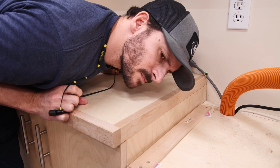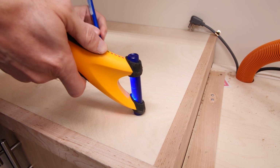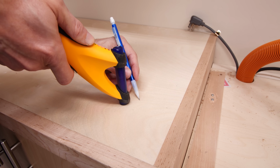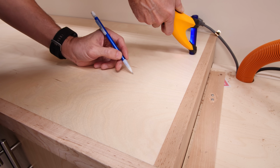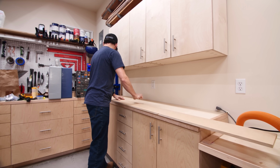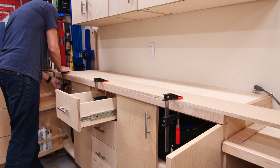And apparently my microphone was off, so it sounded something like this. Beep, beep, beep. I was able to find the screws and some of the brad nails, but I just tried to avoid the screws because there was a lot of brads. Now I don't have an edge guide, so I used a long strip of 1/2 inch MDF cut to size that would put my bit right where I wanted it for the T-track.